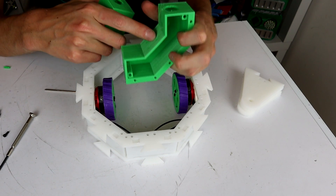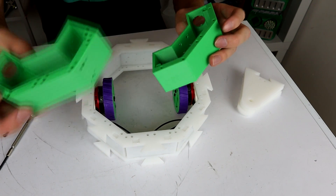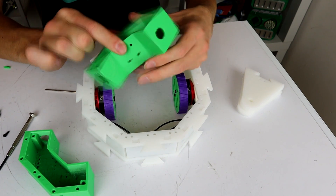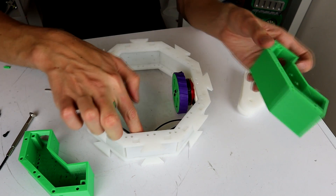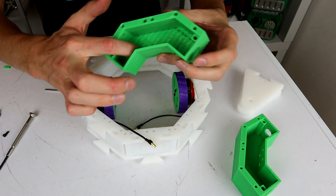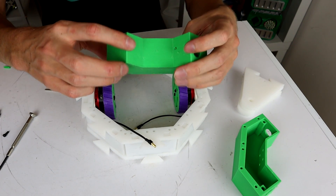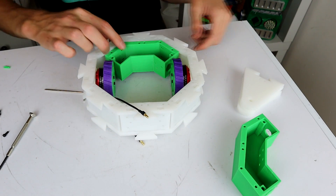Where I've decided to mount my accelerometer is probably not the best place because it needs to be at a pretty exact radius, so this flexible mount is not the greatest — but we're going to try and put these in anyway since I'm not going to get it melting right now. This one's the electronics one which means it needs to go down this side where those wires are. This one is the battery one — the battery has been designed to sit as close to the inner radius as possible, because it's the heaviest thing and the closer I can get it to the internal radius the less impact it has on the inertia. Wriggle this... oh, it does go in!